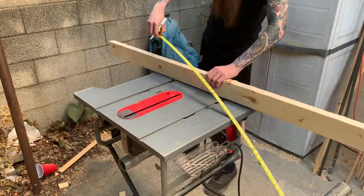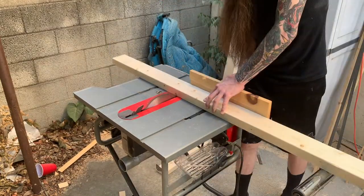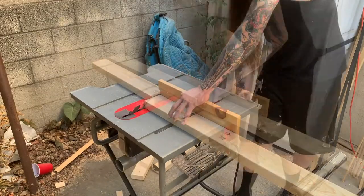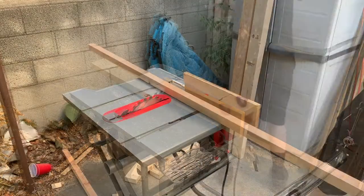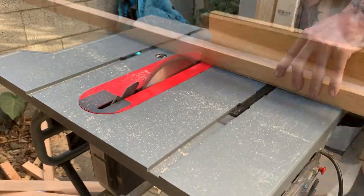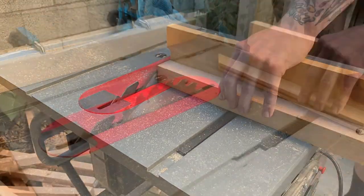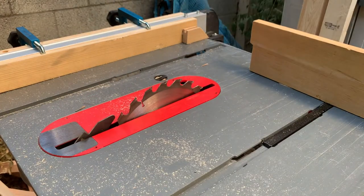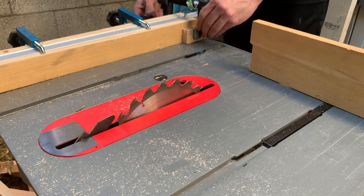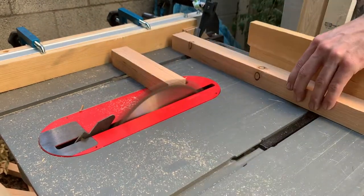But anyhow, I went ahead and went to the big box store and bought a bunch of pine 2x4s, 2x2s, and then I bought half inch plywood. Now I did get a little bit nicer plywood. I believe it was AB or BC plywood, which essentially means that it has one good side. That way, whenever I put the paint job on, the part of the shelf that shows is gonna look nice. So I'll do my best to explain what I'm doing as I'm doing it.